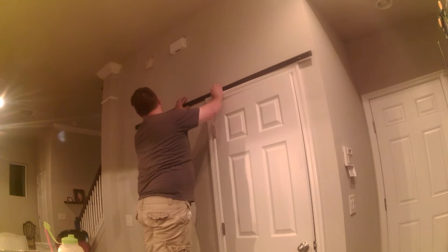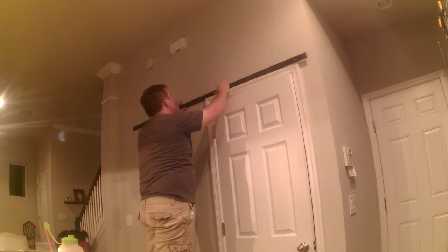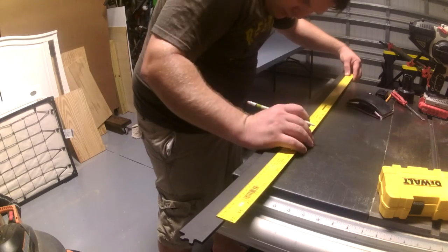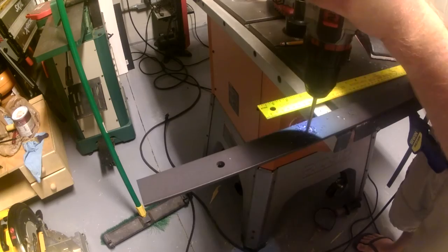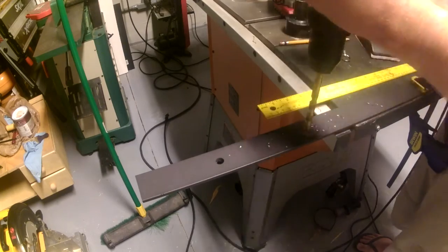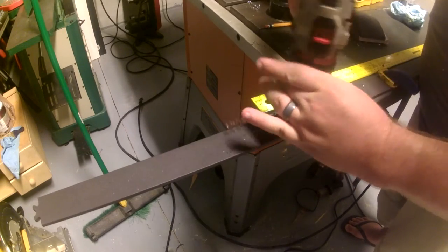The only bad thing about the hardware is that it didn't really line up with my studs perfectly — I think I read that they might have been lined up for European stud spacing. I could get about three of the studs to line up. So I'm marking and drilling some new holes that match up with my studs. You could also mount a 1x or 2x board to the wall and then mount into that, but I'm going straight into the studs.